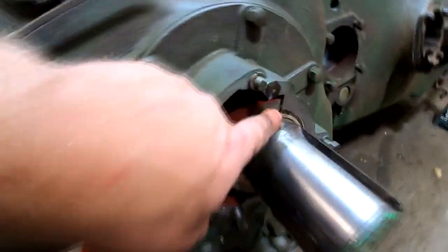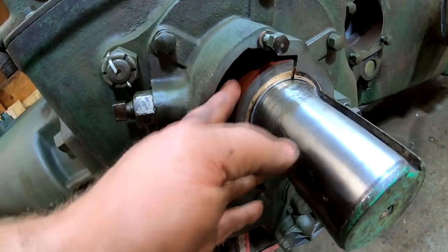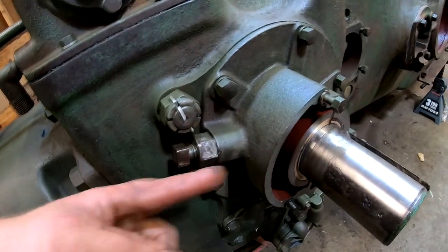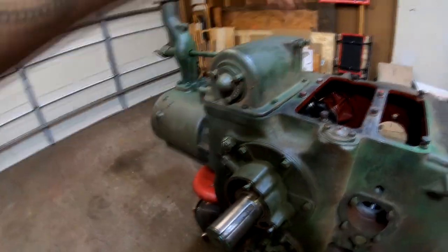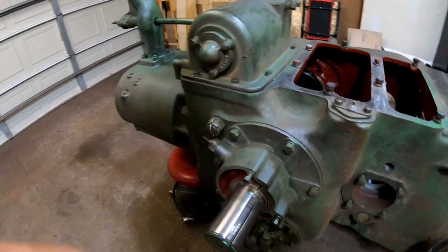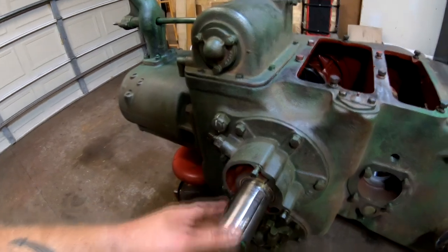So essentially, our main bearings here are shimmed. There's shim packs between the bearing shell. I guess you could call this the clamp portion of the shell, and this is the stationary portion. This is the bolt that drives the clamp portion of the bearing shell into the crankshaft. And we were having an issue with alignment initially, so we ended up making some more shims. They're not the super thin ones, which are about 2 to 3/1000 thickness, but these are about 5/1000 thickness.